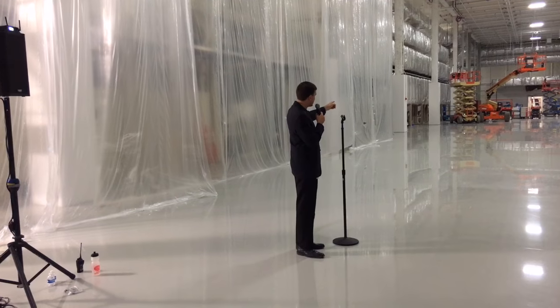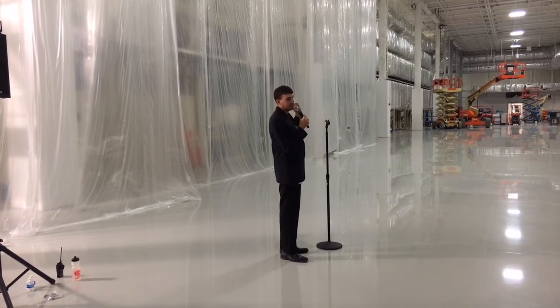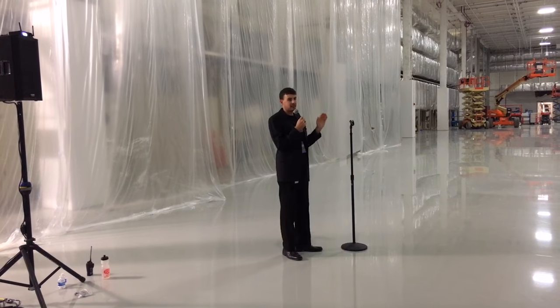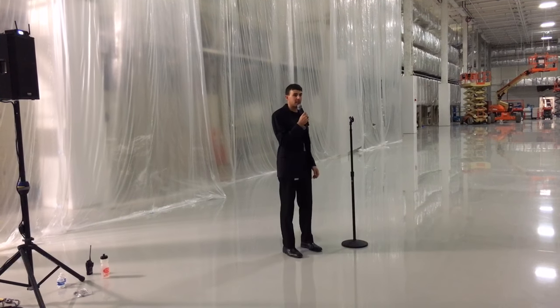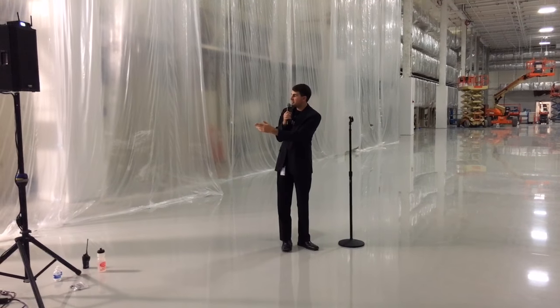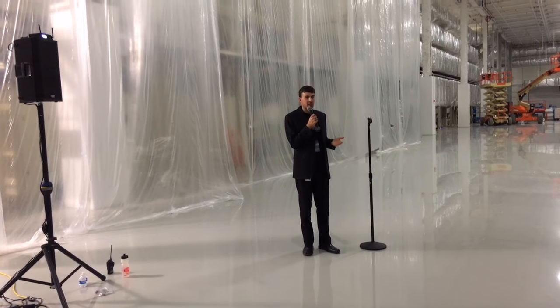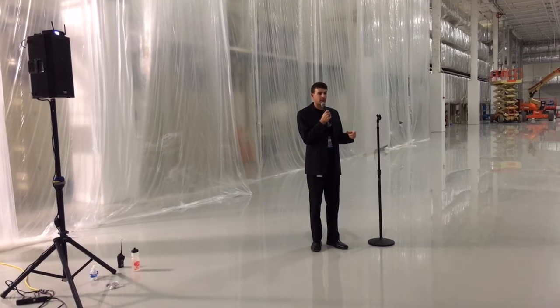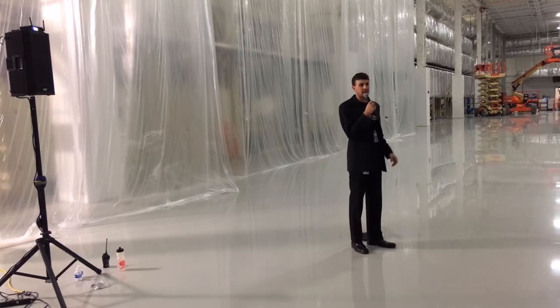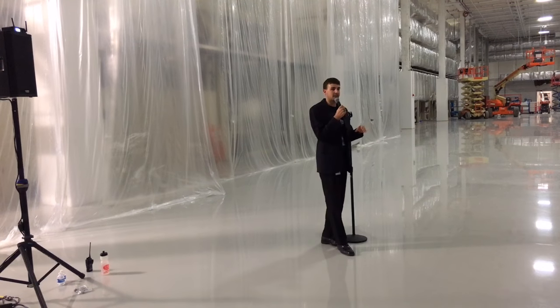That metal then travels along the length of the oven towards us, each chamber having a specific airflow rate in and out and controlled to a specific temperature to evaporate that solvent. So that by the time we're down on this end of the oven, that solvent's all gone, and we're left with a thin metal foil with a solid active battery material attached to it.